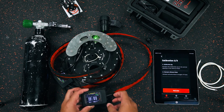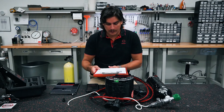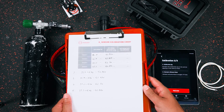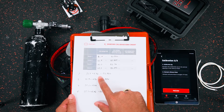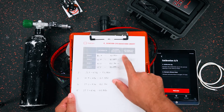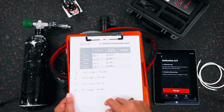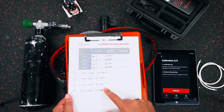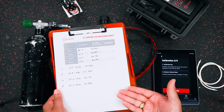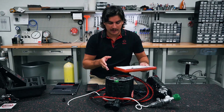On the handset, I have not clicked start yet. On our paperwork we entered all of our values. The way we do this without the application, we need to do a little calculation to see what we expect to read on our sensors. We multiply by 4.76 — that's the coefficient of the slope for a perfect reading. This is what we hope to reach. The expected values are: sensor one 50.932, sensor two 51.884, sensor three 52.36, sensor four 52.836 millivolts. We're going to do plus or minus two millivolts, then see what we actually get.